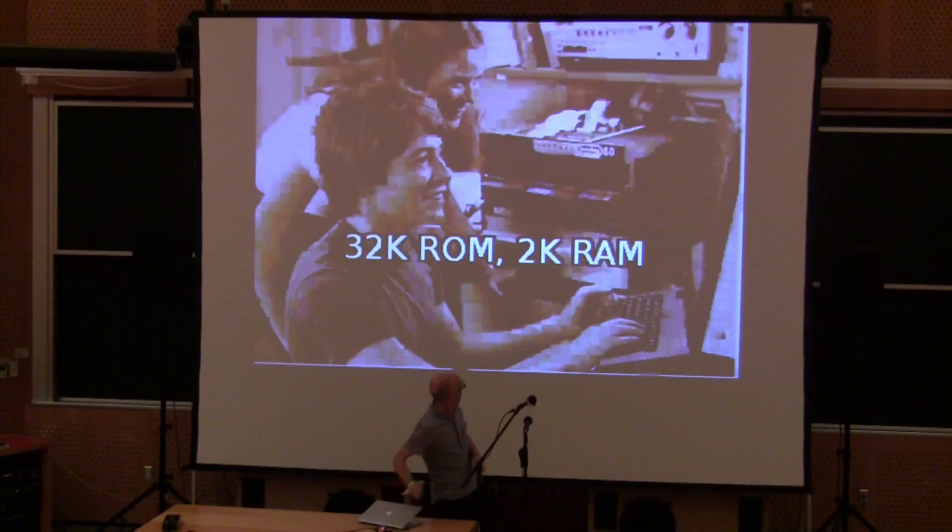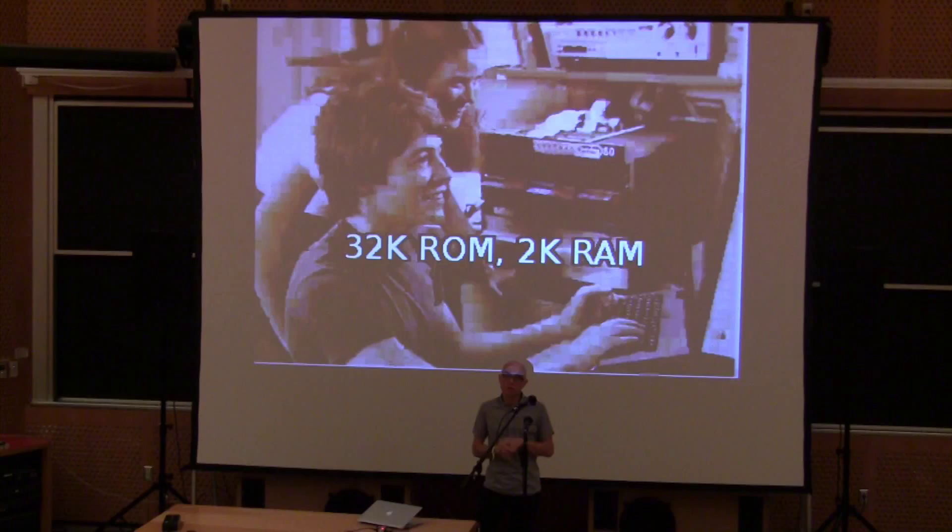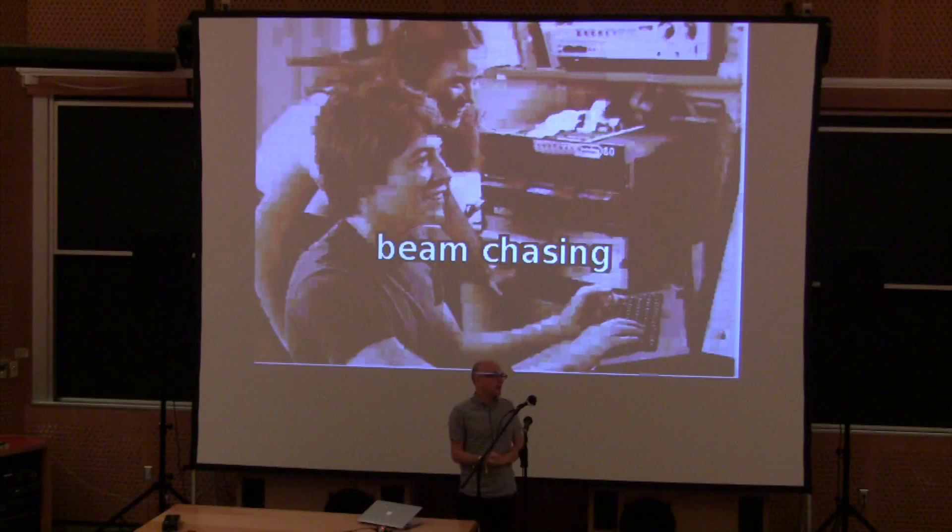The Arduino itself, which we can't really change, is the CPU platform we plug into. It's not that great — it's an 8-bit CPU with 32K of flash and 2K of RAM. It's about the same as a Nintendo NES in CPU capability. These retro techniques are what you have to do to let a small computer generate and animate an image on screen. If you want to do something fancy, you have no option but to go right down to the hardware level and deal with things at the raster timing level.